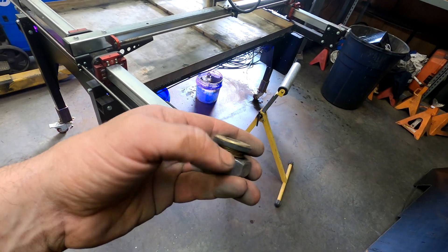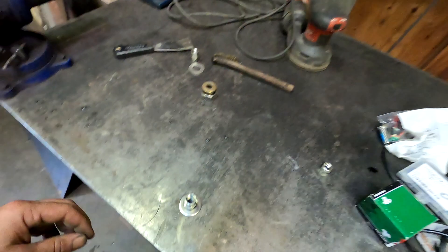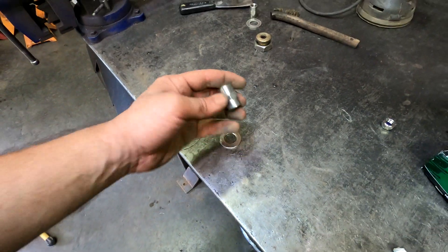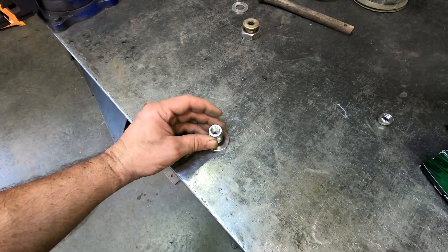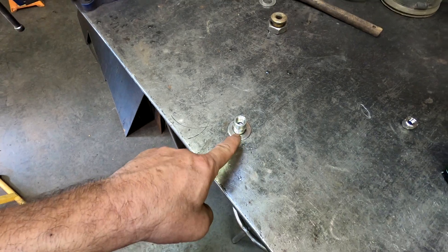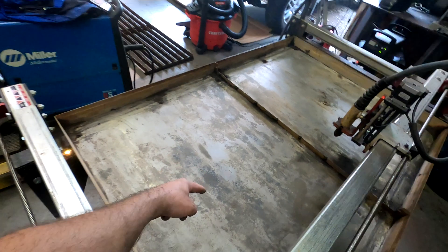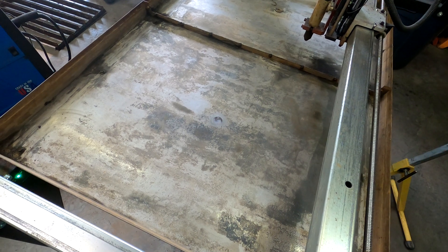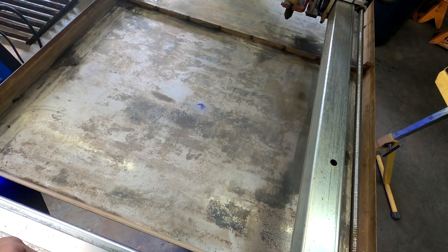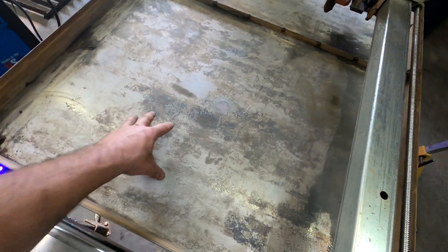With that lip there, not all of the water drains out of the water table when I drain it. I wasn't going to do anything about it today, but I changed my mind. What I've got is these quarter-inch NPT nipples and a stainless steel washer. I'm going to TIG weld the nipple to the washer, then put that assembly up from the bottom and TIG weld it in place. Assuming I do a decent job TIG welding, that will be a bomb-proof, leak-proof way of doing this — and there'll be no lip, so I'll actually be able to drain all the water right down to the surface. Let's fire up the TIG welder and get to work.